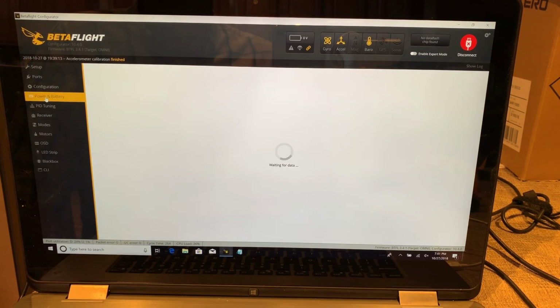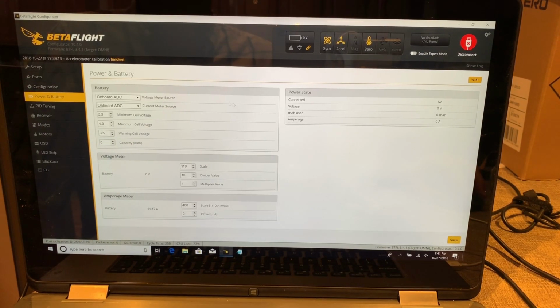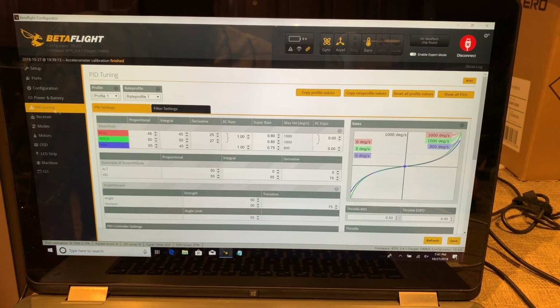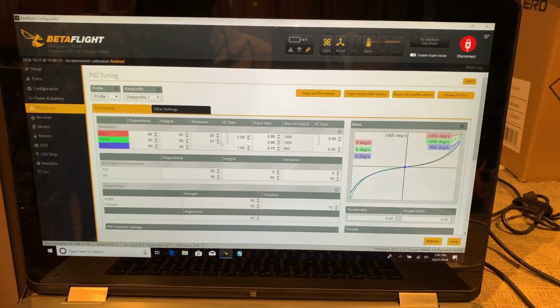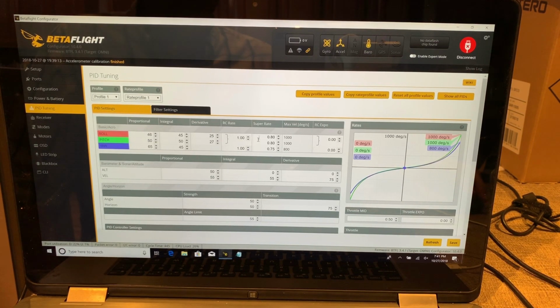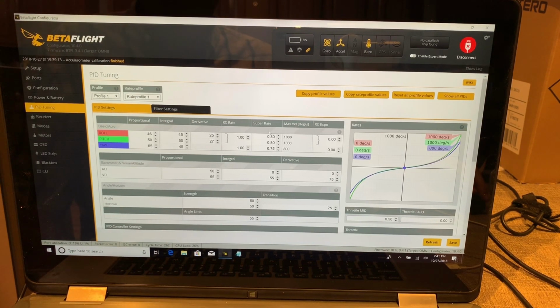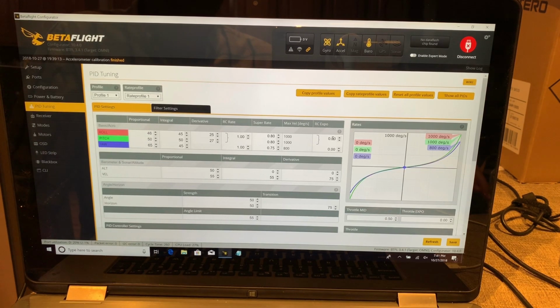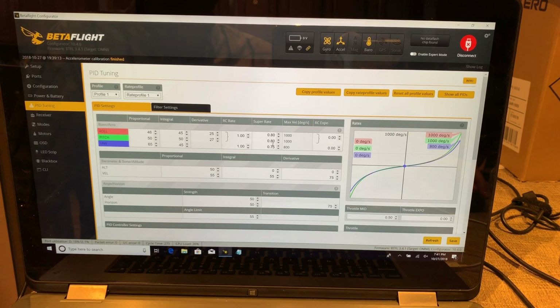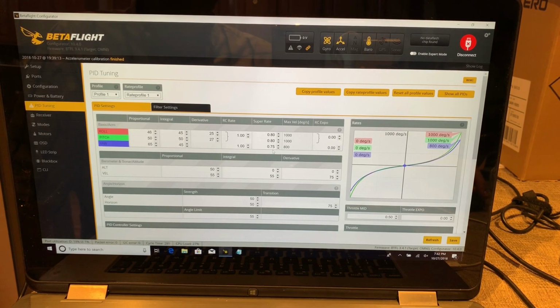I didn't make any changes in the power battery management. These values were fine for me. Let's see, PID tuning. I basically just kept it at the Betaflight defaults. The only thing I changed was the rates. These are my rates. I mean, that's a personal preference. You can try them out, see if you like them. Mine are pretty boring. I don't have any RC Expo, and basically it's 0.8, 0.8 on my super rates and 0.75. I do have my rates on a switch